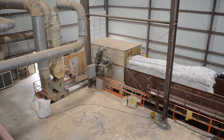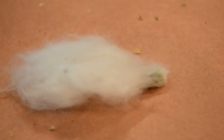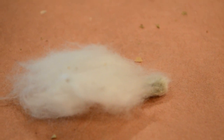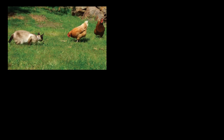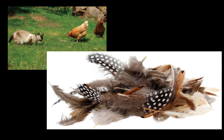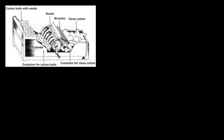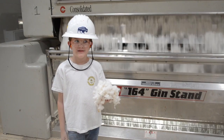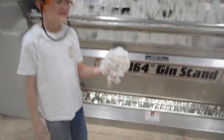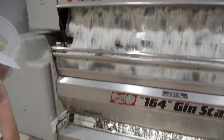The whole process is called cotton ginning, but the actual ginning is when the fibers are removed from the seed. Pulling fibers off the seed used to be done by hand — it was slow and tedious work. Legend has it that Eli Whitney was watching a cat try to pull a chicken through a fence and saw only the feathers come through. That gave him an idea to design a machine that would hook onto the cotton fiber and pull it through a narrow gap. The fiber fit through the gap, but the seed would not — and the cotton gin was invented. The operating principle remains the same today, but instead of small hand-cranked gins, these big modern gins make quick work separating fibers from the seed.